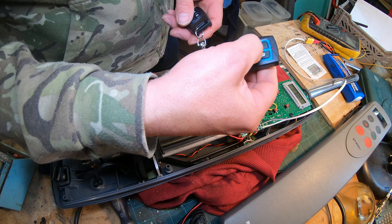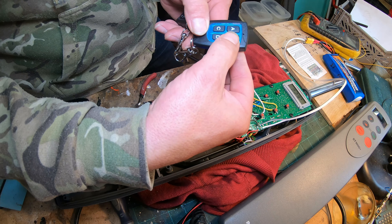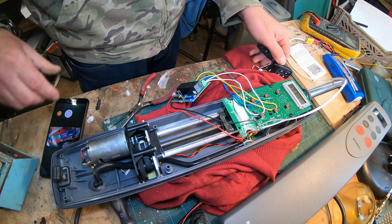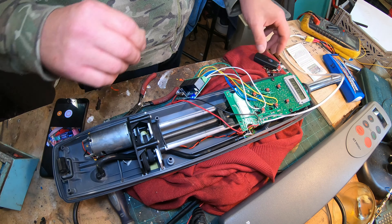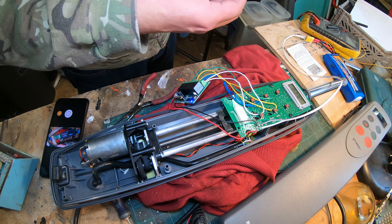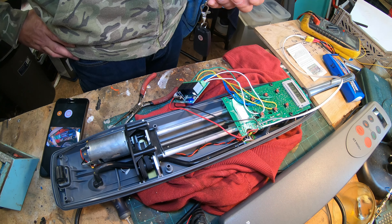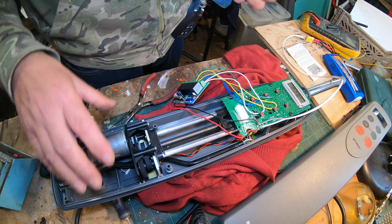So this is the normal adjustment — A and B. That's minus 10. It's not in autopilot mode, so this is adjusting to fit the tiller before you switch it on. You switch it on autopilot using D — it's now in autopilot mode. The unit thinks the boat's turning, so it's adjusting to suit. We're back on course. That's standby with C — takes it out of autopilot again.